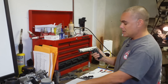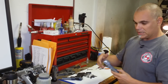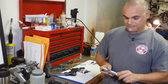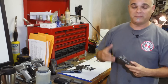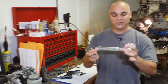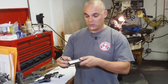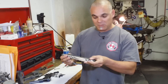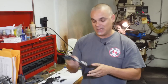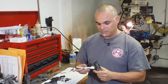We do this for aesthetic reasons, but we also do it for functional reasons. We want to reduce the recoil. We want the follow-up shots. We want maximum accuracy. So we reduce the weight of the slide, we move the recoil point forward, we machine sights in them, we machine serrations in them, we flat top them so they're a little bit lighter — much easier to see the sights — and then we use these kinds of barrels.